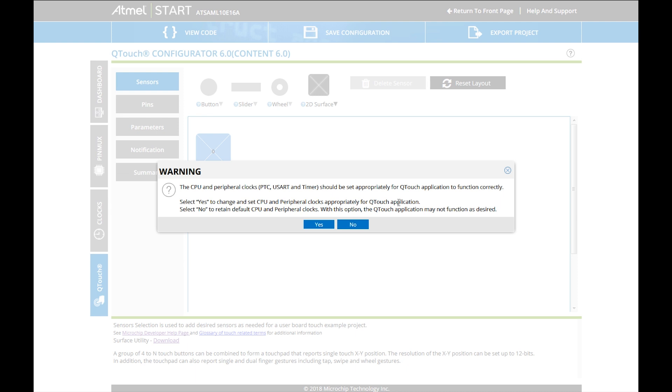With sensor configuration, we get some info about what's involved. We will use some hardware resources of the chip, like the PTC — the Peripheral Touch Controller — which is expected as we are going for a small touchpad. The UART module is also involved; we will use UART to stream out our data and visualize it with our 2D touch surface GUI. And we need some timer resources.